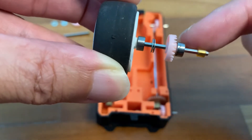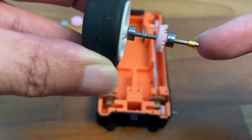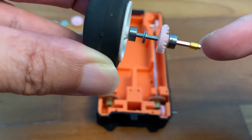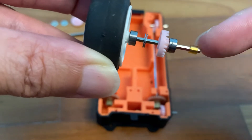After the inner bearing I have this tubing — this is the standard 2mm inner diameter nylon tube. This will act as an efficient end stop to prevent the shaft from sliding out.